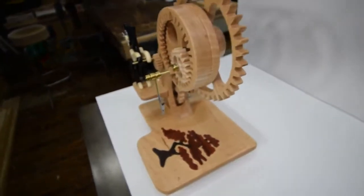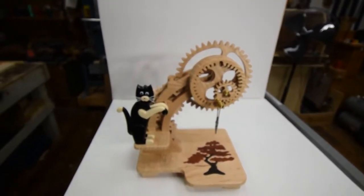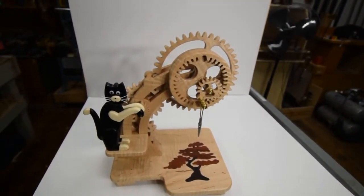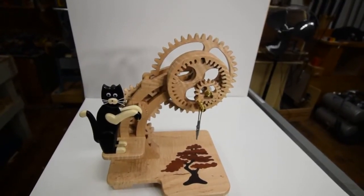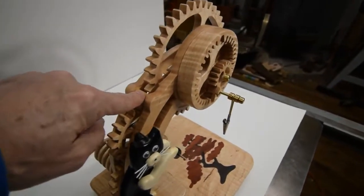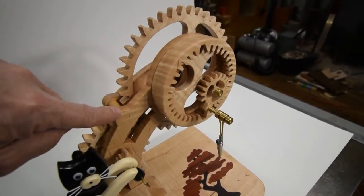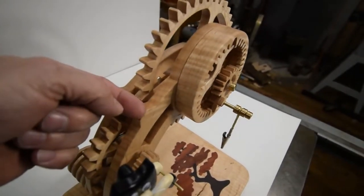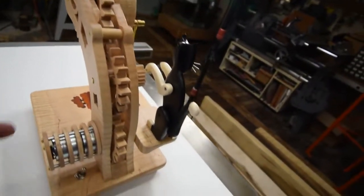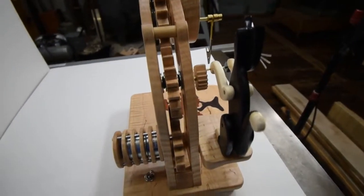And again, if you'd like to build one of these for yourself, the plans are available from Clayton Boyer, B-O-Y-E-R. And like I said, make these plans your own. Make whatever changes you want to make. Like this dowel on his plans drills right through so you can see the end grain. I didn't want to see the end grain on this dowel, so I just drilled a stopped hole and glued it in because there's a screw that goes in there and 2 screws back here so you can disassemble to access your axles and gears.